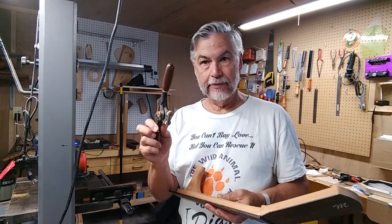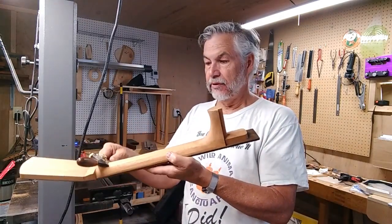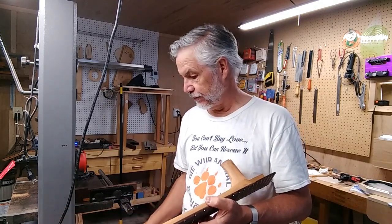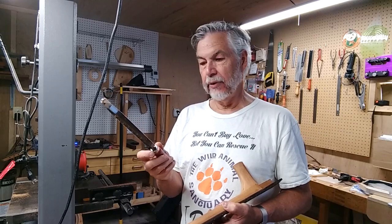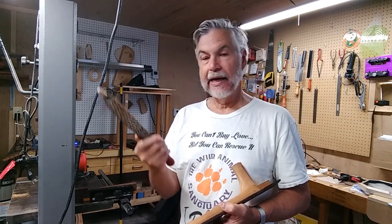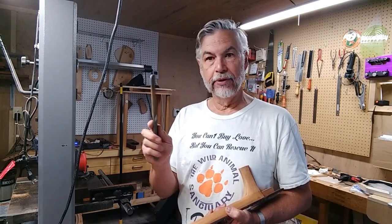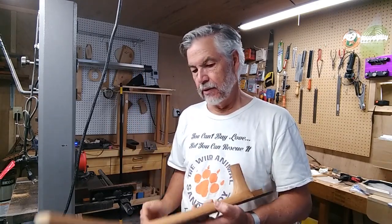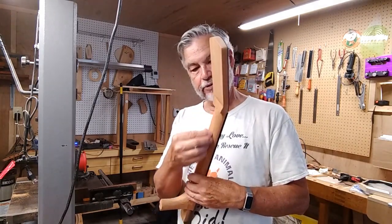You go to the expensive tool — really expensive — and it works fine and gives you a nice arch. But it doesn't really work well in this rowed grain scenario. So this ends up being the tool of choice for a lot of this — a rasp made out of hacksaw blades, basically. This thing digs deep. When I need to go to a finer mesh, I get the standard 4-in-1 rasp. This one happens to be a Schmidt — the nicest one I've got.